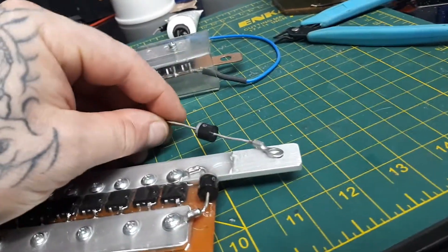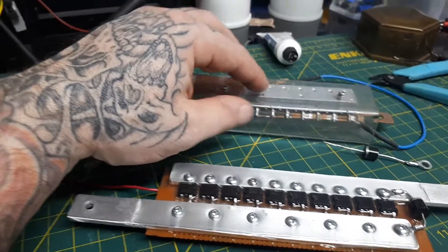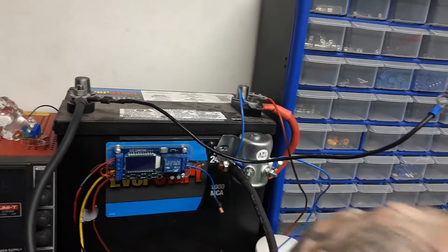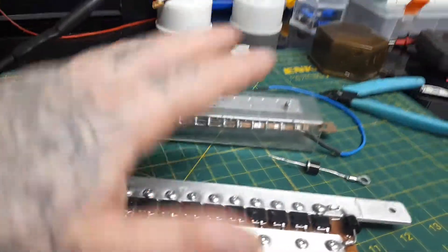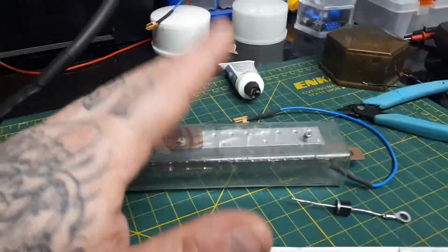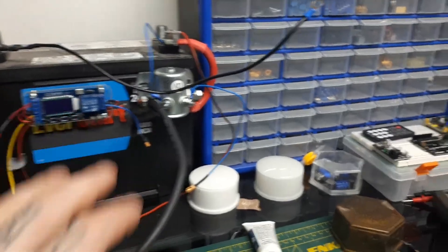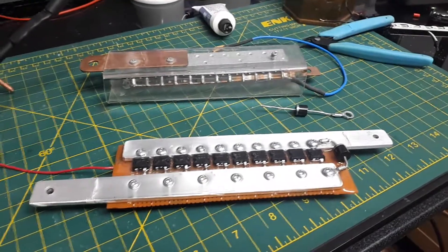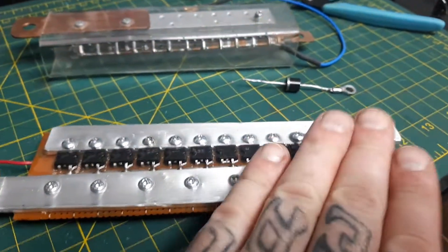So we use a diode to direct the back EMF, and as a backup we use a blocking diode — that's this one right here. I did over 5,000 welds on this one and another one in the drawer, both using the double one-amp high-voltage rectifying diodes just redirecting the positive. I also tested with no diodes — those welders only lasted one weld. So we know: no diodes means it blows up after one or a few welds.